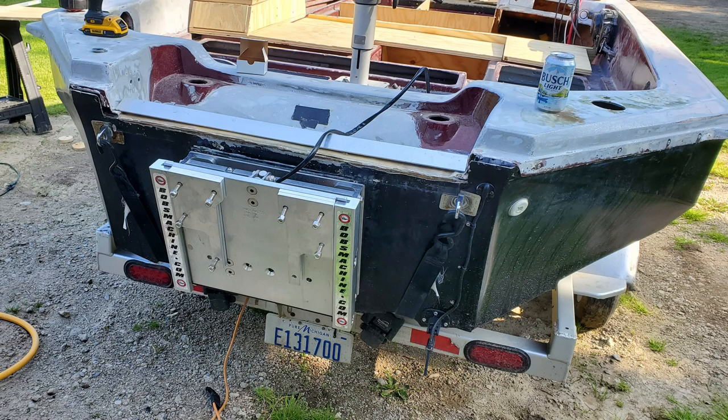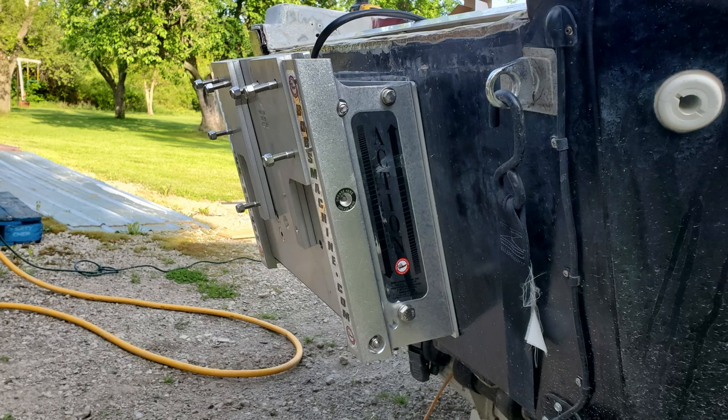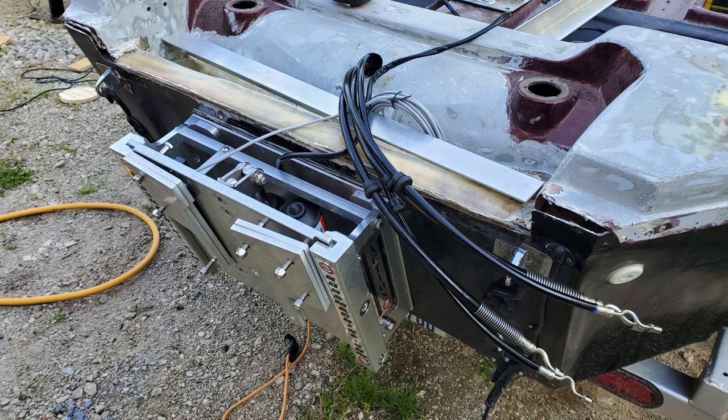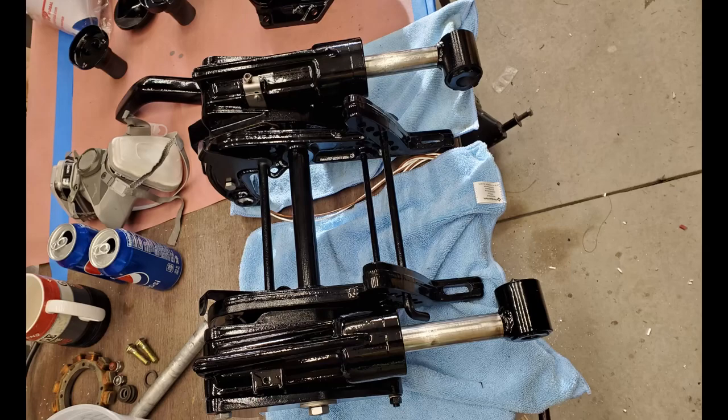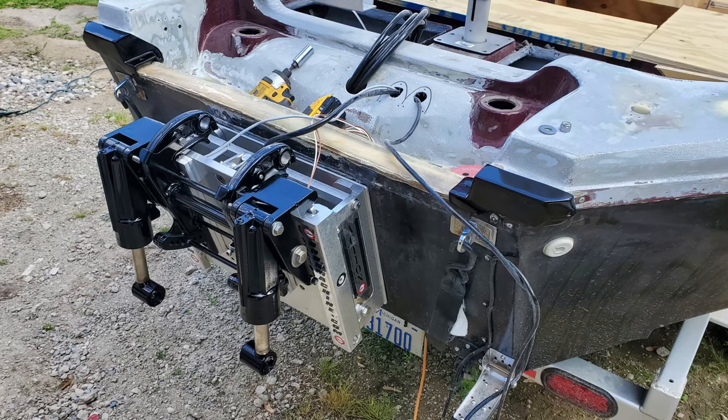The jack plate is a beauty and I picked it up from Bob's Machine. It's plenty powerful for outboards up to the 120 horsepower range and it adds six inches of setback from the transom. This was fitted to get a new attachment hole scheme laid out and to figure out the routing for all the various rigging. I located an OEM power trim unit for my Mercury, which was cleaned, bench tested, and repainted. This attached to the jack plate using some custom-made aluminum spacer plates and stainless steel hardware.